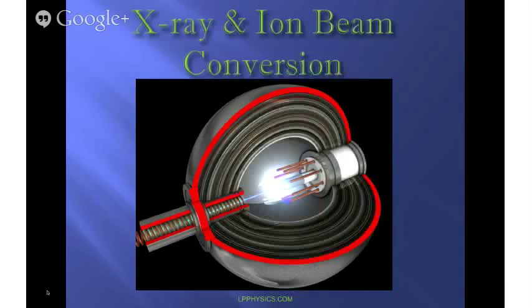Good question. Obviously, repeatability has always been a problem with the dense plasma focus. You do get a lot of difference shot to shot. Now, with our machine, we've got it to the point where it's clearly a non-Gaussian distribution. We can get 5 shots in a row that you can lay right on top of each other. In fact, sometimes I wondered whether Derek saved the wrong data. But the 6th shot could be off in yield by as much as a factor of 2. So if you take everything, you're going to have a factor of 2 variation in almost any of these variables. But it's not Gaussian. It's obvious that you've got a semi-stable mode of operation.